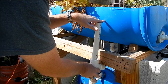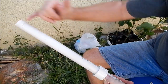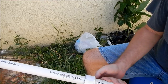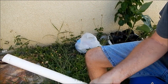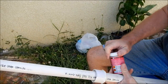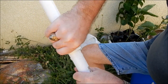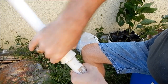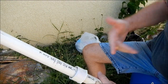I know where the water needs to be, so I set it up to be at that height. Now we know this is the height we want. The problem is you can't put the fitting inside the joint normally — you'd just put glue on the end and put the pieces together. So what we do is we spin it as we bring it down, twist it to get a good thick joint, and then we just let it sit to dry.